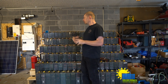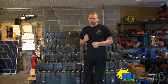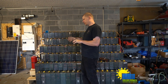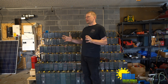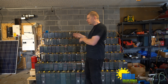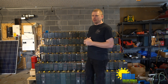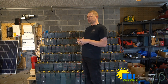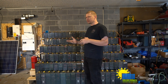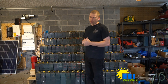I also added a 240-volt circuit to a computer. Why do that since you can just plug it into 110? Well, these computers pull about 1700 to 1800 watts when plugging into a standard receptacle. I need to reduce the amperage through the wall, so I ran an extension cord directly to it and there's no problem — the heat I was having when I plugged it in was completely gone. When you have a lot of amps you get a lot of heat, but if you remove the amps by doubling the voltage you sustain the same power consumption with less amps and can use smaller wire, making it safer.